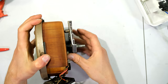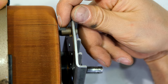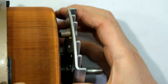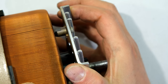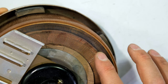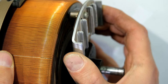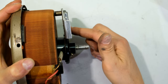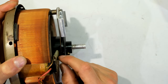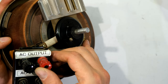If you look closely you might see there's a piece of carbon here — we sometimes call this a carbon brush. I'm going to lift it slightly; you can see that it's resting on the top of the windings. Notice how the windings are available for this brush to move past, and that is what allows us to vary the output voltage. The slider is electrically connected — there it is — there's the terminal; it comes to the output.